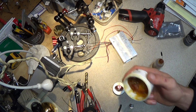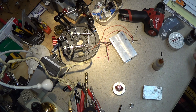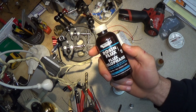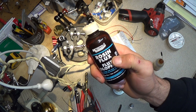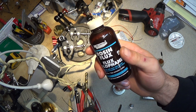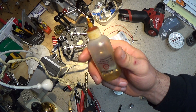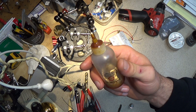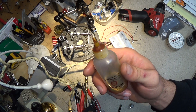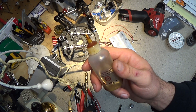So I eventually switched over to a liquid flux. This is made by MG Chemicals and I really like this flux — it's really good stuff. I started using it in a dropper bottle, which is nice, but it's still difficult to apply because sometimes you don't need a full drop. As crazy as that sounds, on a circuit board you want a much smaller amount.